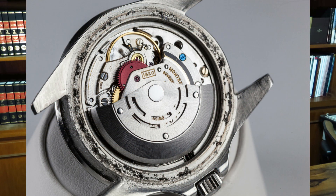Rolex realized that these watches under severe use started developing pitting corrosion points. This happens especially near the junction of the case back and the case, which can lead to a water resistance problem in the future. I've personally seen many watches made with 316L steel with this kind of problem, and that's why Rolex decided to use 904L — to make the watch more resistant to that kind of abuse.